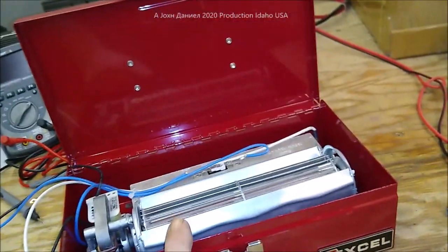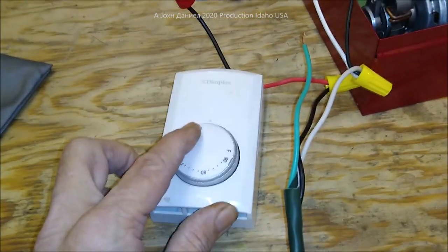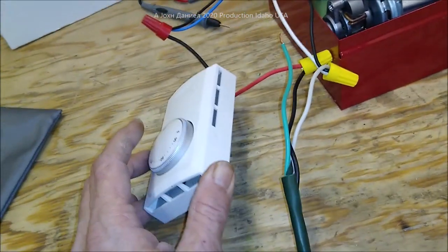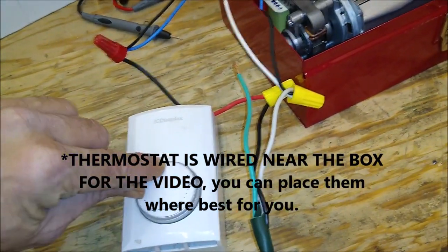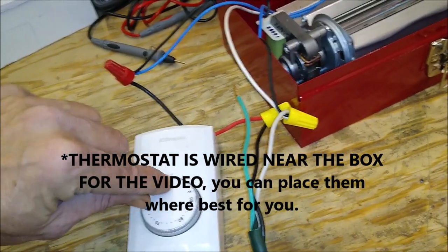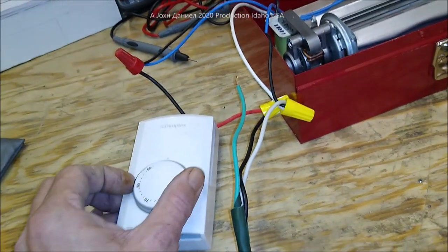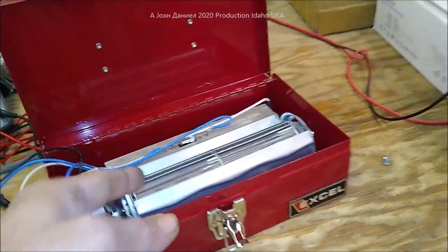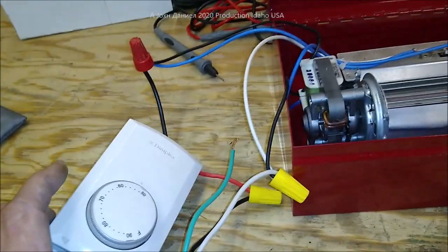This lady with the bus has a 50-amp service, so we're going to put two on one leg of the 220 split and one on the other leg. These can be controlled by this thermostat — I'll put a link below. This one is special: it will go down to 39 degrees, 37 to 40 with 39 centered. So if you don't want your RV to freeze in the wintertime and you don't mind spending a few dollars running 640 watts, get it, make it, build it, use it.